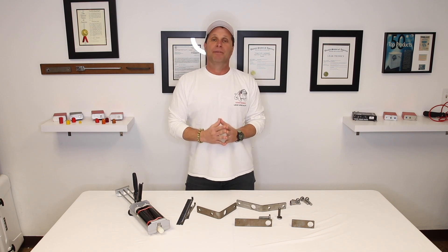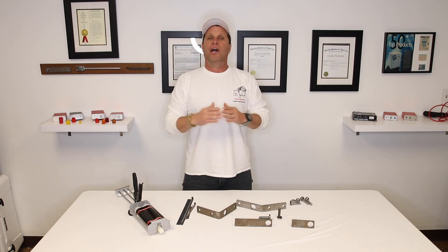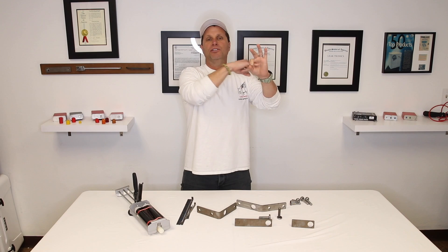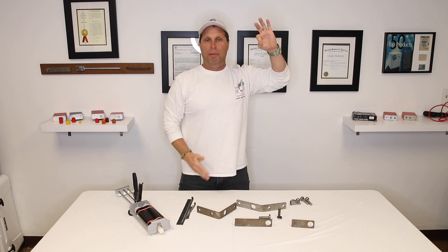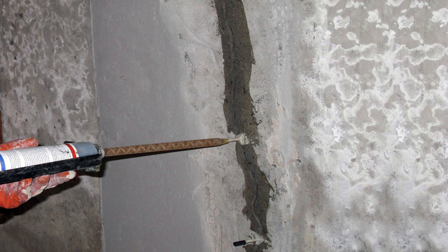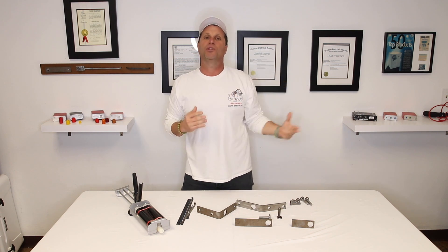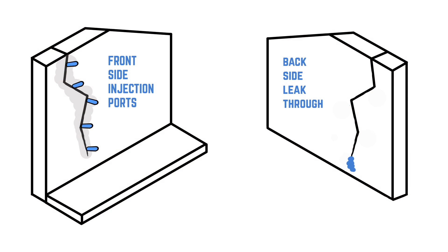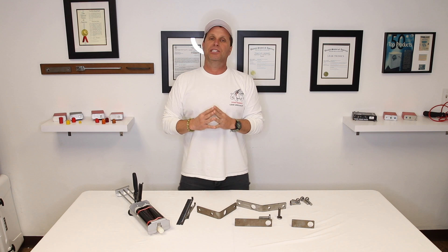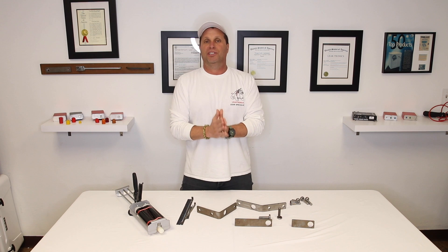It's going to re-crack again. The reason is, when we have a subterranean structure — meaning it's buried, it's underground — and we have one wall to work at and we don't have exposure on the back wall, you're pumping epoxy into a structure and you're not getting full penetration. When companies say they show you port-to-port penetration, all you're literally seeing is what's on the surface. Most of the time you're literally pumping epoxy behind the wall, it's dripping down, and it's not really getting into that crack. I've tested this over the years. I've done structural repairs where we actually dig out the backside of a pool and we can see that we don't get any penetration.